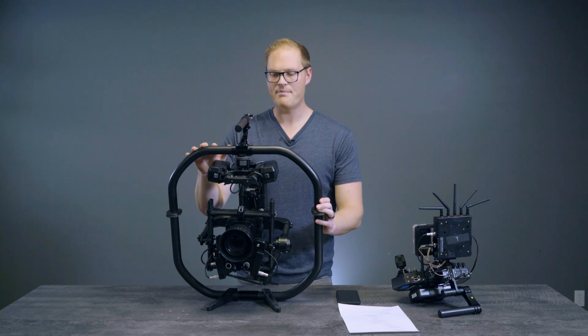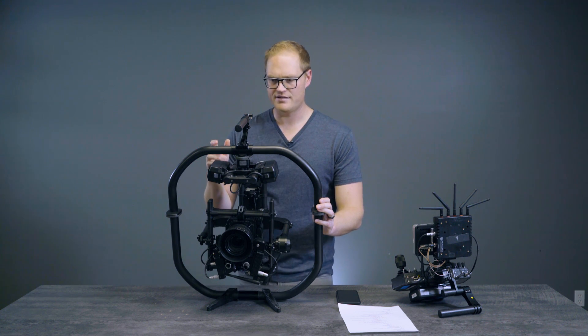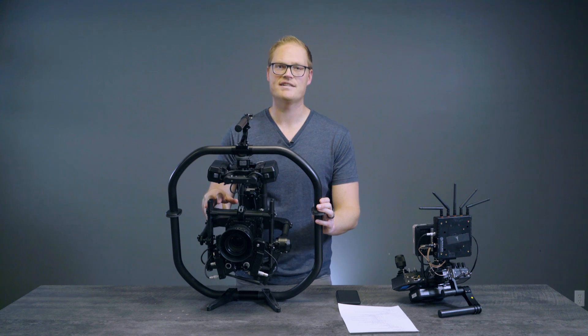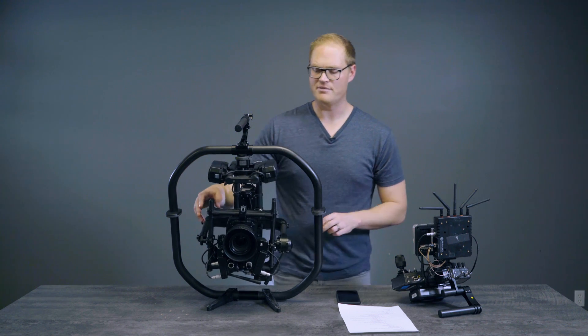We came back with Blackjack for Auto-Tune version 3. What that does is it tunes stiffness, filter, and inertia of the camera package so that it can define an acceleration limit. I want to explain a little bit about why that's important.